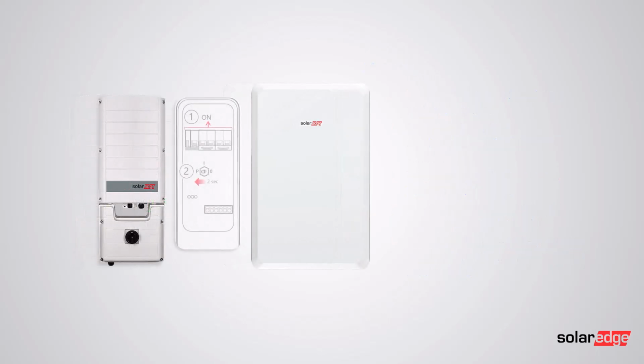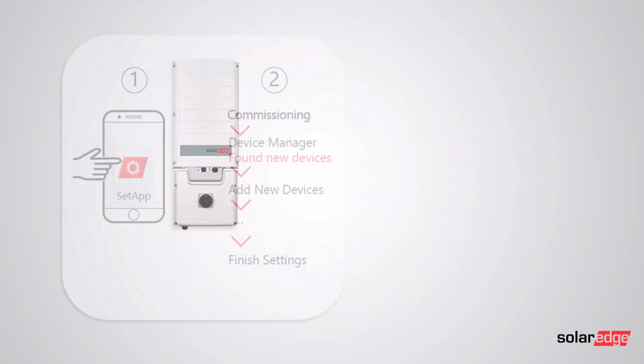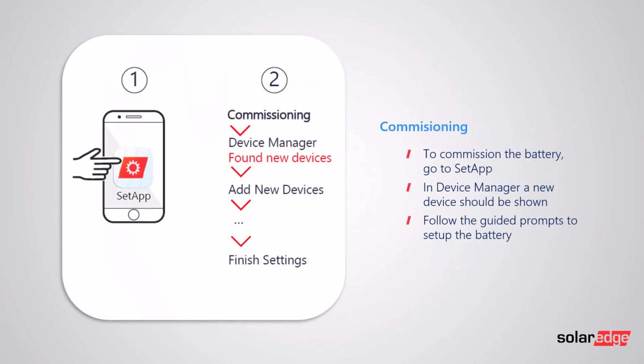Once everything's installed, go through the normal commissioning process, that's turning on the battery, then turning on all the DC isolators, and then moving the AC onto the on position, and then just do the commissioning as usual through setup.